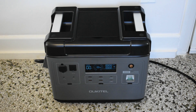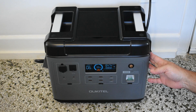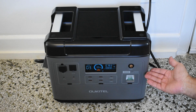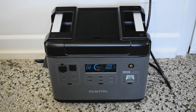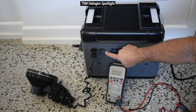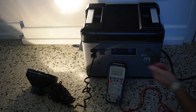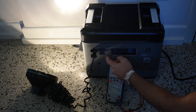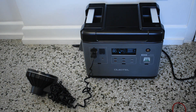Five minutes after the test finished, the unit is charging just fine — no overheating delay required, unlike many power stations that need 30 minutes to an hour to cool down first. Charging to just 2% to take a quick look at the DC output voltage: the XT60 reads 13.55 volts, so even after full depletion you still have well above 12 volts at the accessory socket and XT60. Overall, this is a very good product — a little pricey, but it works extremely well. I'd say this is the best portable power station I've tested yet. Thanks for watching.